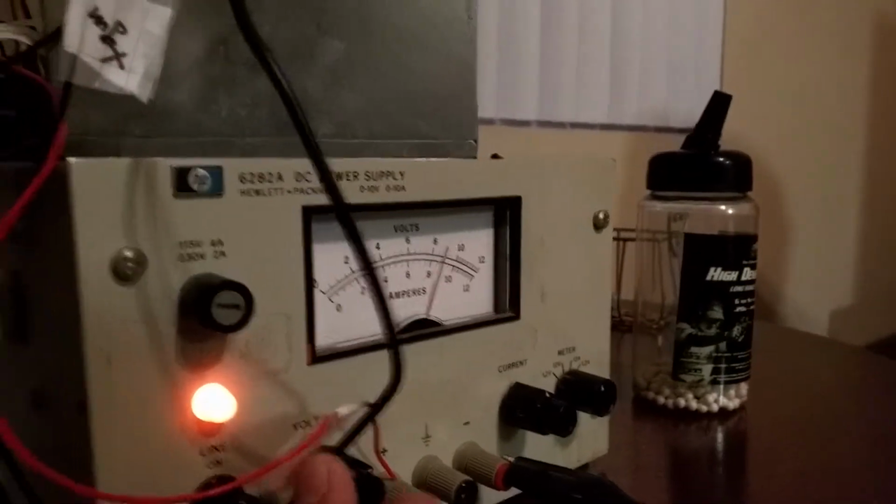To control the gun, it operates at about 8.5 volts. And so to interface that with the Pi, we have it connected to a relay. And simply pushing a trigger button would activate the relay and activate the gun.